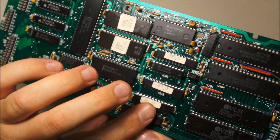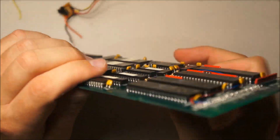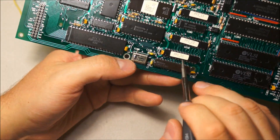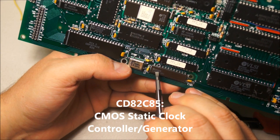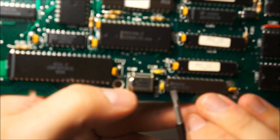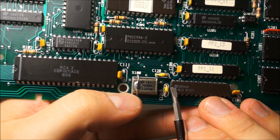We've got some interesting stuff — this is a big CER dip. This isn't a plastic dip — that's a ceramic dip package. I wonder why they use such a mil-spec part there, because especially since that's just a CD82C85 from Signetics. No shit! Yeah, I'm pretty sure that's Signetics — I think that's the Signetics logo.